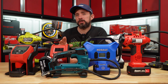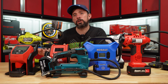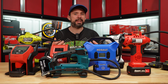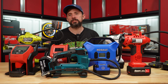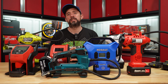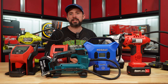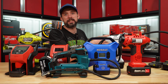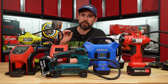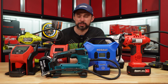That being said, I wouldn't use these for anything bigger than a car tire, a lawnmower or tractor tire, wheelbarrow, something like that. I would not recommend these for truck tires, ag tires, anything like that — these just cannot handle that sort of work. You can get it done, but keep the duty cycle in mind. For those applications, you're going to want to step up to the next size, which we will test in an upcoming video, or even a cordless air compressor. These are for small stuff — maybe a basketball, a lawnmower tire, up to a car tire.